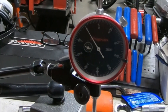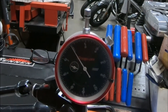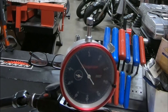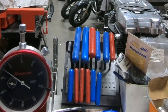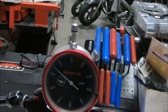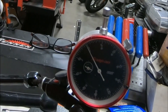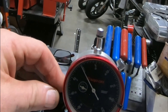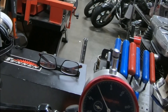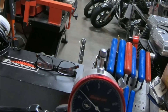This is a half-thousandths indicator and I have it set on zero, so I'm going to lift up on the case slightly and let's see where we're at. That's one, two — we are at two and a half thousandths. Let me check again: one, two — if I pull up very hard I'm at two and a half, but that's almost lifting the flywheel assembly off the table here. I reset my gauge: one, two — maybe two and a quarter thousandths. So we have absolutely nailed it the first time. Excellent.